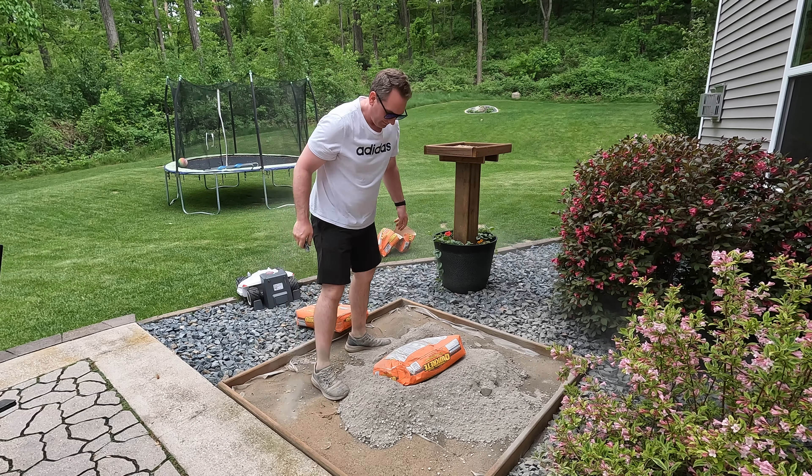After taking care of the edges, I got a wooden float and tried to evenly distribute the mixture between the cement and the aggregate, trying to get a more even mixture and deal with those pockets of aggregate. I'm not saying this is the best solution — it's what I came up with. The results are okay; I made it work. Please put in the comments if you've got a better way to do this on a dry pour, because to me this is kind of the challenge. After the float, I used a paint board to give the entire surface a uniform texture. This worked extremely well — it put a very nice texture on and smoothed everything out. That's an awesome little trick.